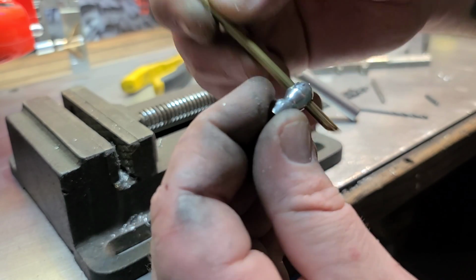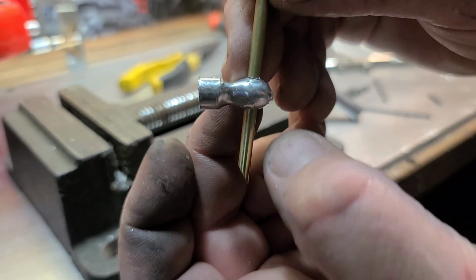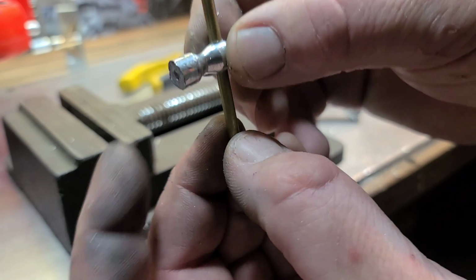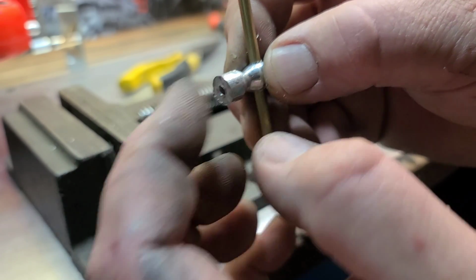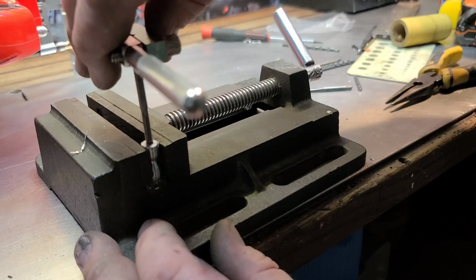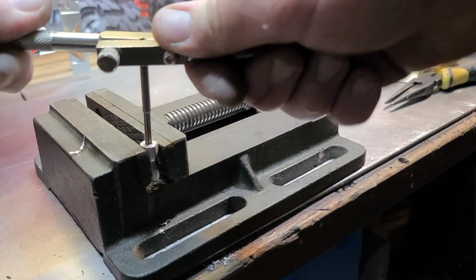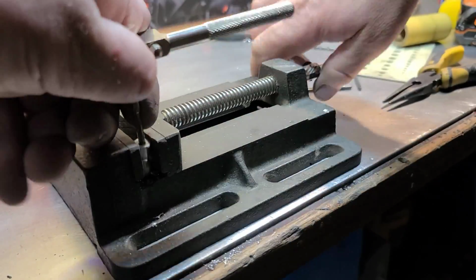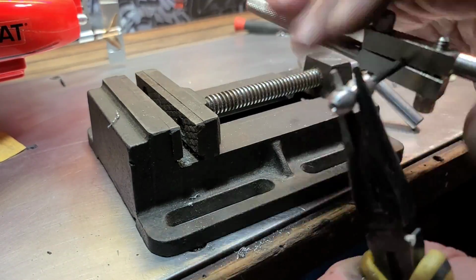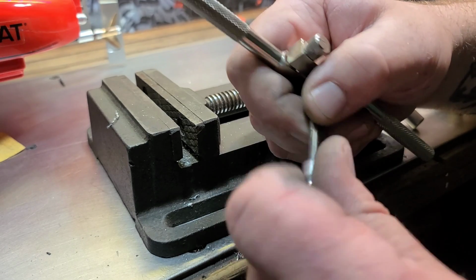Alright. Actually, we'll probably do it this way so it picks up water better, because I drilled it at an angle because I'm a big dummy. And then we'll tap this side and this side so we can put a grub screw here to catch this tube, and on this side we'll put a screw to keep it in place on the boat. Raining outside, can't go do nothing. Alright, so I've got my tap, 4mm. I recommend 3, but 4 is going to work. Now you're done.